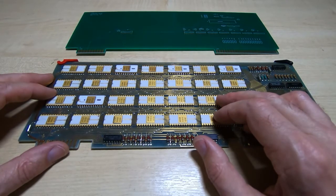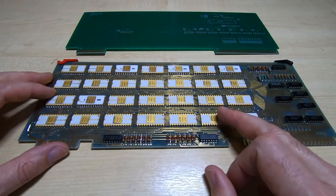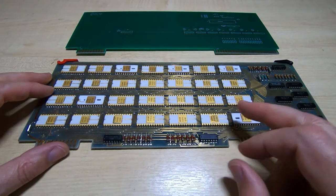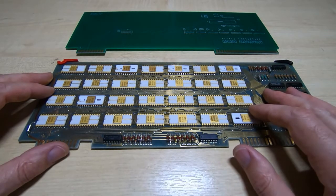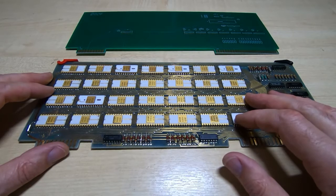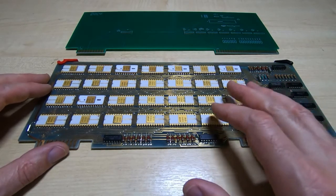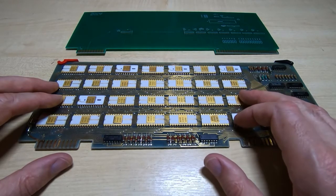They should never be both high at the same time. I have drawn out a logic diagram for the Address 8 lines on the original ROM card, and when it's in the machine they're only ever driven high one at a time. But there are times when they are both low, and it may be that that is a requirement for the machine. Whether or not I will need to add a small piece of logic to make sure that the address lines are properly decoded and control the output of the EEPROM accordingly, I'll have to wait and see. Unfortunately I couldn't find a datasheet for these EEPROMs, so I'm not quite sure exactly what happens to the outputs when both lines are actually low.